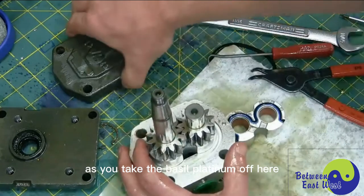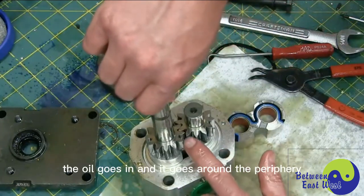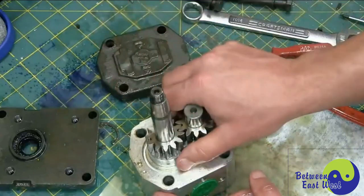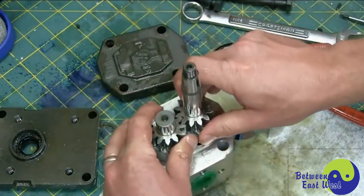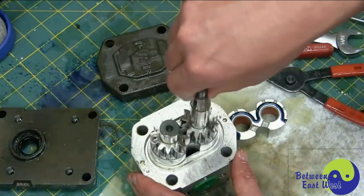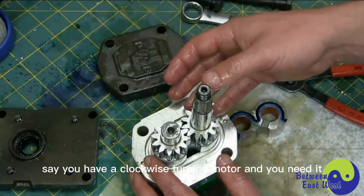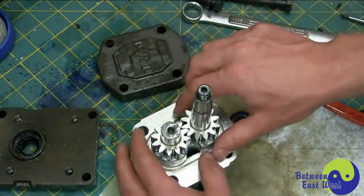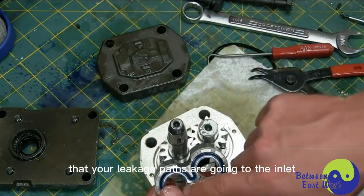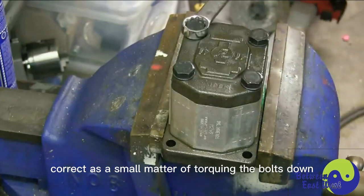You take the basal plate off, like this. You just have to consider — the oil goes in and it goes around the periphery. This one is turning clockwise from the shaft end. And conversely, if the port were over on the other side, it would need to turn counterclockwise. Knowing that, if you buy the wrong pump — say you have a clockwise turning motor and you need counterclockwise rotation — all you need to do is split the pump, turn it around, making sure that your leakage paths are going to the inlet. Now we got the assembly in there correctly — it's a small matter of torquing the bolts down. Click.